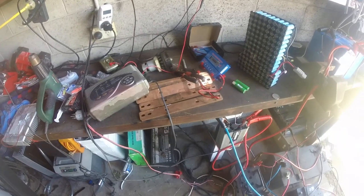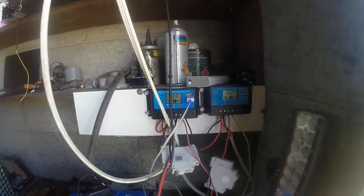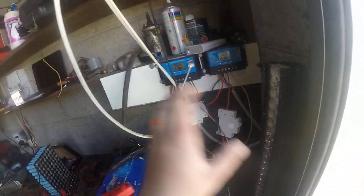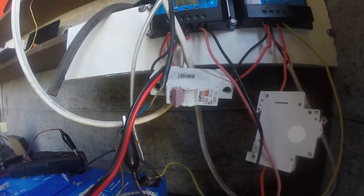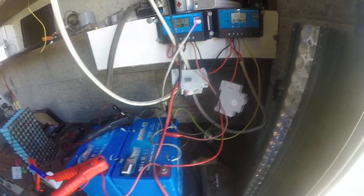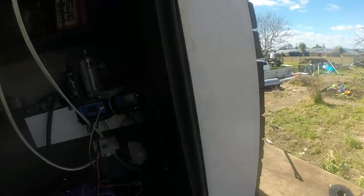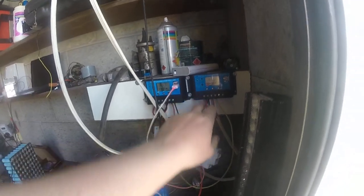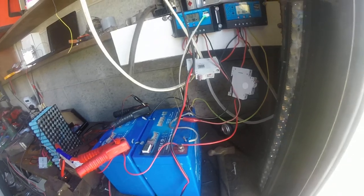What's up YouTube, I thought I'd give you a bit of an update today on what I've been using my solar setup for. As you may remember, I've got these two — it's very messy at the moment. I've got breakers in because I was trying to see if one of these controllers could handle three panels, but they can't. The breakers are just being used as switches — I bought them for $2.20 each, 63A AC house breakers. We've got a beautiful sunny day out here today, plenty of power coming in, so the power from the charge controller goes straight into these two semi-sealed deep cycles.